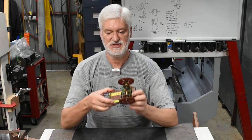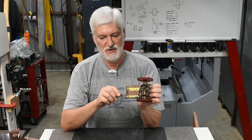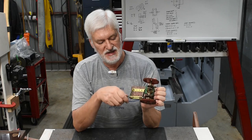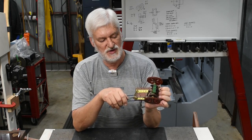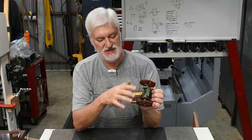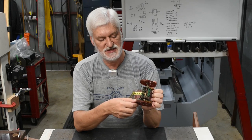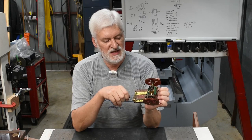So I knocked something up from my old boyhood Meccano, and people familiar with these things will recognise what's going on straight away. In the car situation, you normally have four what they call spider gears here, and this central spool which can rotate with the wheels or allow one wheel to turn at a different speed in relation to the other. So when you're going around a corner, the inside wheel doesn't turn as quickly as the outside wheel. Anyway, no magic with any of that.